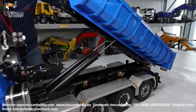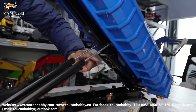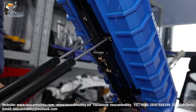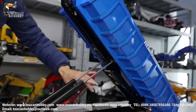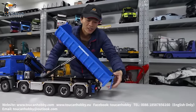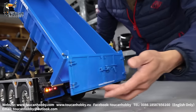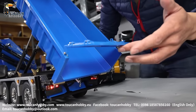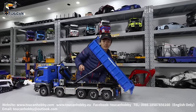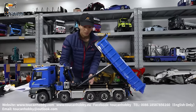So when you're dumping, do not slide into the rear side, because when you're sliding, here will be unlocked, this one will bend and drop, and the bucket will damage it. Dumping is dumping, no sliding. After you're raising the dump, the rear side lock is unlocked, the door directly opens. So now it's in position, almost like 45 to 50 degrees for the rising, put it down.